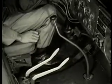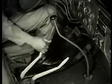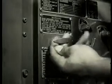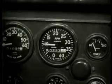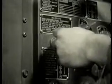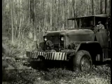In the driver's cab, shift transfer case to neutral. Shift transmission to neutral. And shift the winch control lever to reverse to pay out the cable. Using the throttle lockout, regulate the engine at a steady speed not to exceed 1,000 RPM. Here the cable is shown being paid out under power.